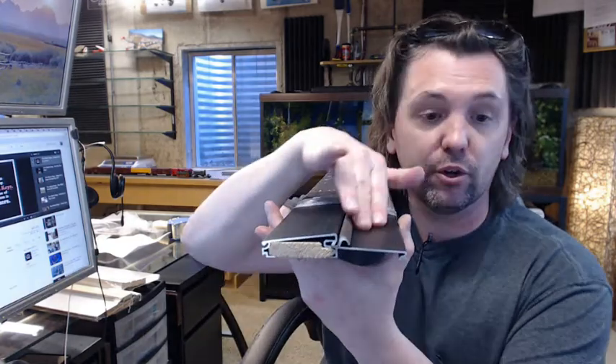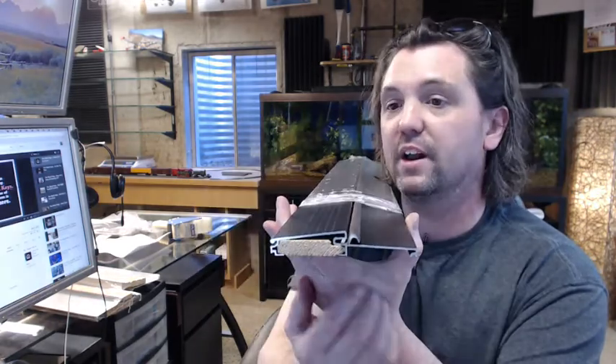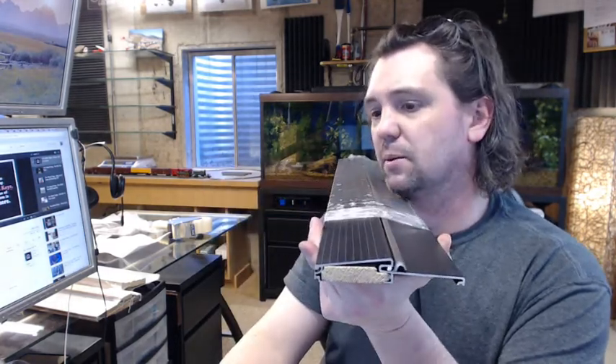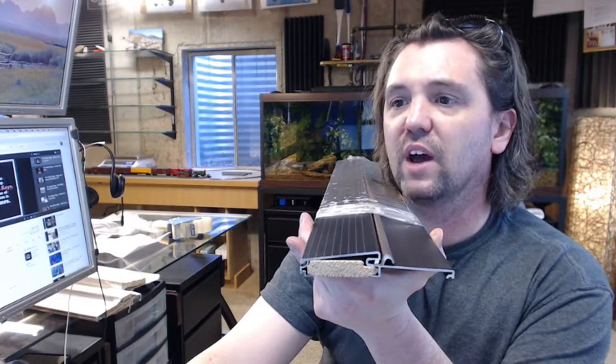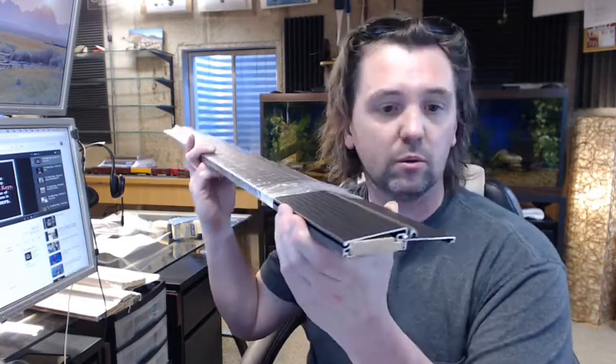They are a fixed sill, so your door is going to reside in here. You will want to work with this before you determine your cut-out exactly. If you are cutting a frame around it, you will need to know the slope of everything — that is typically 5 degrees. If you need to confirm that, reach out to us and we will get back in touch with you.